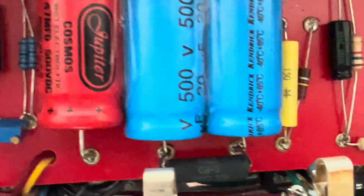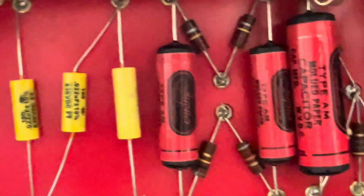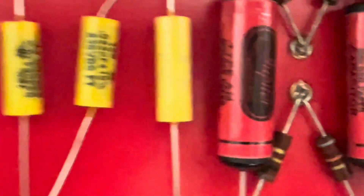The knit I have to pick today would be the quality of the solder joints, but I don't want to get too far ahead or be overly critical because I've seen a lot worse. This needs to be reflowed — it may be better on the back side but this just looks like trouble to me. Otherwise, very nice quality, very nice build.